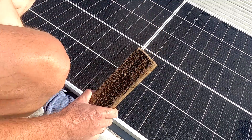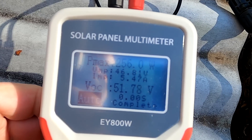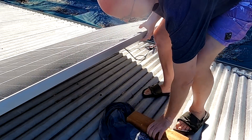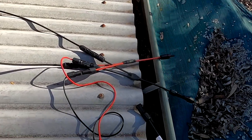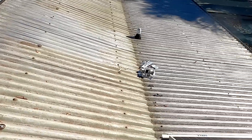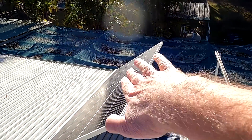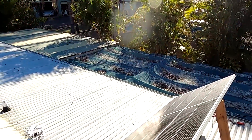Let's see if a bit of an angle makes a difference. At a moderate angle we get 250 watts, at a steeper angle 274, and at a very steep angle 278. This is the same piece of timber I'm using down at the solar farm, so they are on the same angle. The sun is coming at about 20 degrees right now.